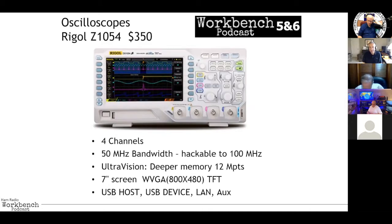Oscilloscopes essentially give you a two-dimensional graphical view of typically a voltage on the y-axis over time on the x-axis. So what you can do is probe a signal and measure the voltage just like a voltmeter, but it shows it to you in the vertical axis where that point is. And over time, it draws a line on the screen as you're taking samples. So everybody's seen an oscilloscope before. You see a sine wave or a square wave or some white noise. You hook it up to a speaker, you can see the voice modulating on the oscilloscope, all that sort of stuff.